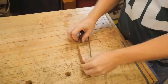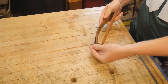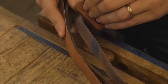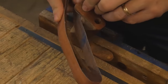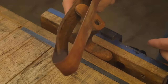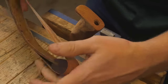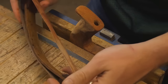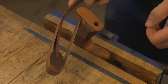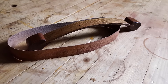The strips of sandpaper you can cut to whatever thickness you want and they just pop on. Now you have this bow that allows you to sand curves rather nicely so you can get into handles and other things like that. You could make the paper smaller if you have thinner curves to get into. Once the paper starts to load up in one place and is hard to work with, you can just roll it along the sander to get some new paper. It's a really nice setup — and if you need a stiff side you can use the back of it. So there is the sandpaper bow. A lot of fun.